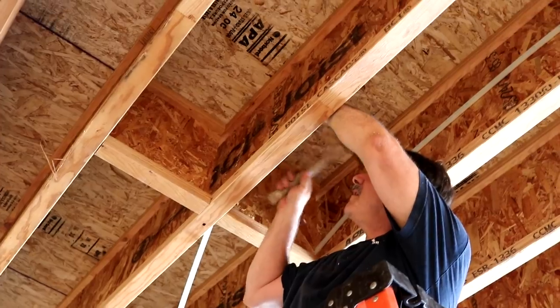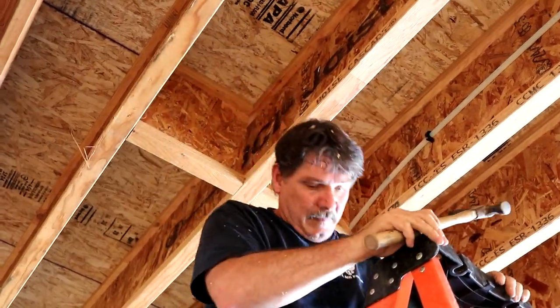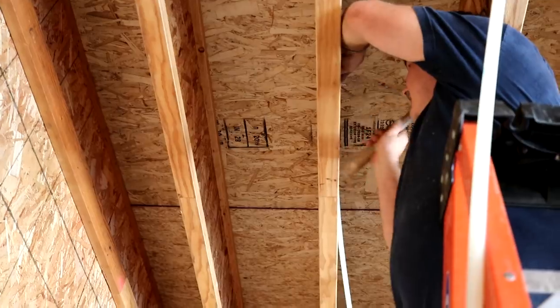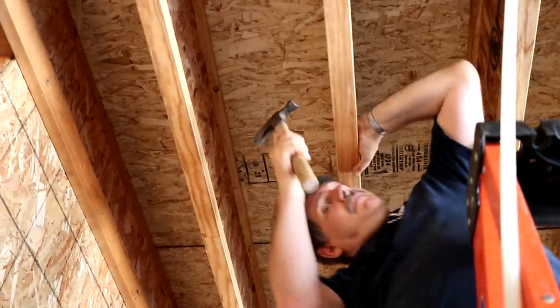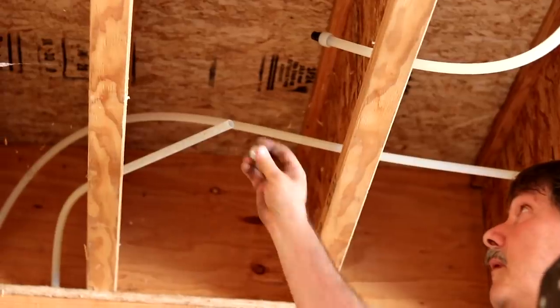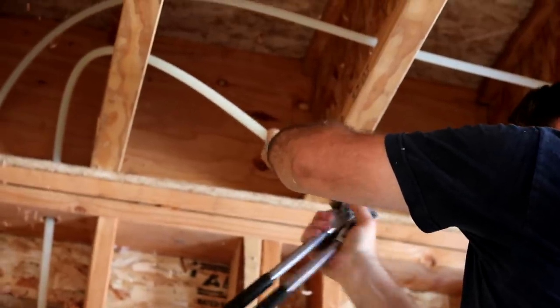There are a few more parts to this plumbing system that are going to show up in some later episodes. Hooking up the water heater, the hose bibs, a few odds and ends. The important thing to know, however, is that you want the plumbing all the way done, including being thoroughly tested and inspected if it's required, before you insulate and drywall.